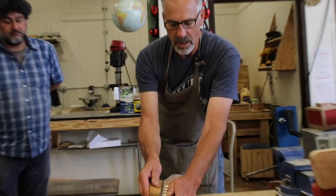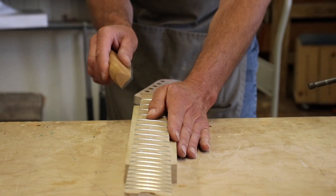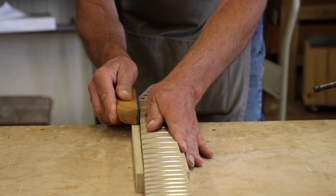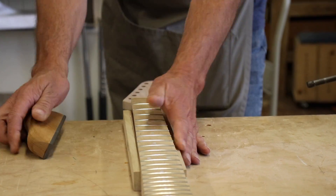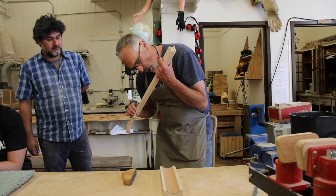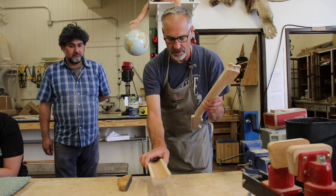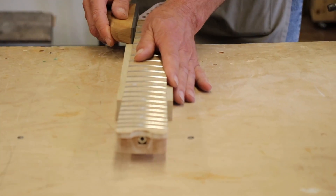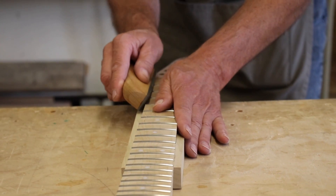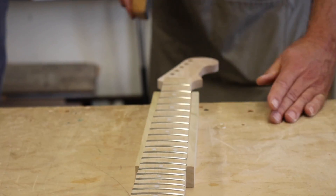Then we need to turn the file roughly at a 45-degree angle — between 30 and 45 degrees — right about there. That's going to be the beveling. Here's a caution: you'll get lots of little bits of metal, so it's a good idea to keep that clear, because they're going to fall down in the trough and start working their way into the wood. Always go forward the full length and get a little bevel.